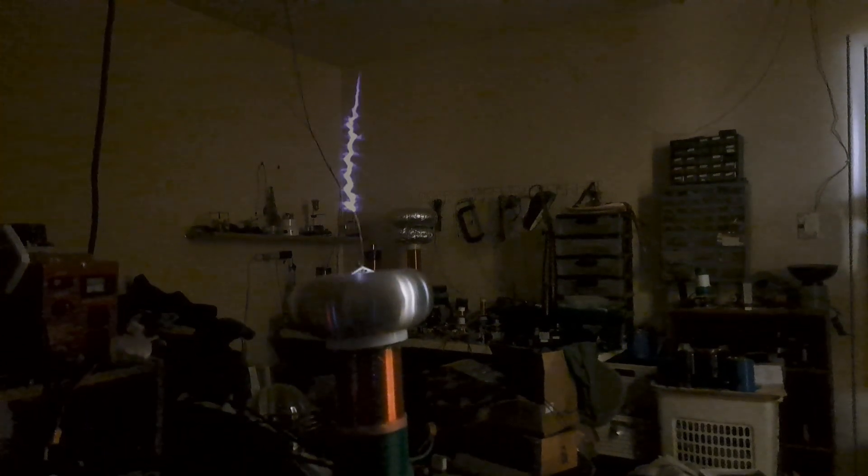That's close to 200 volts DC. That one's more like 175. So that's about line voltage — or at least the equivalent of peak line voltage. Getting about 246 volts, and that ramp is about 8 milliseconds.